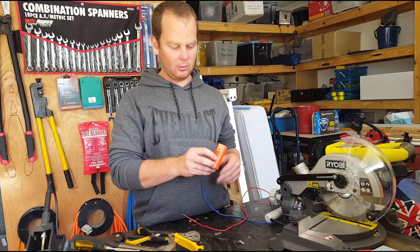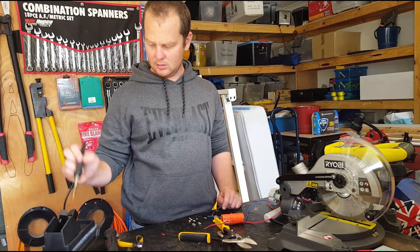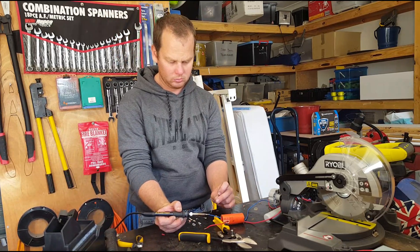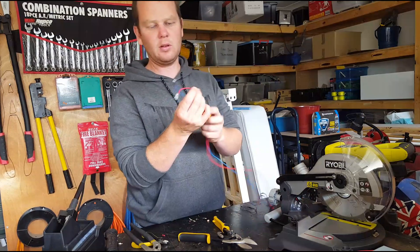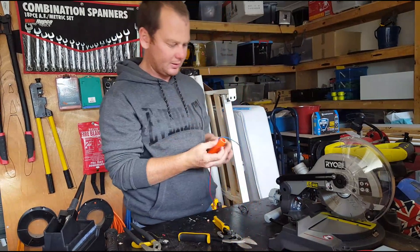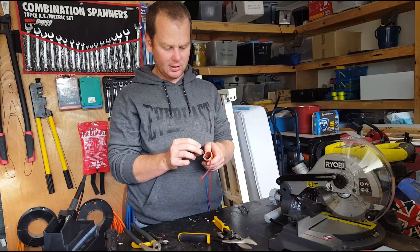You can feed the wires through the little hole made in the slot. You're going to want to tin up the end of your wires and your little contacts that you've made. You're going to need a fair bit of heat getting that soldered up — have your machine on nice and hot. Just on the back of each of the contacts, a blob of solder. It's going to be hot, but you're going to want to push them down. Make sure they line up through your little holes you've made before.